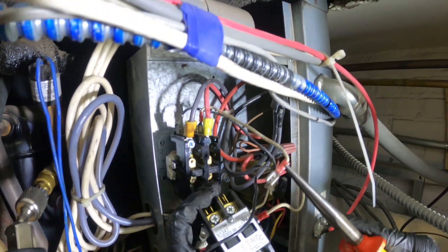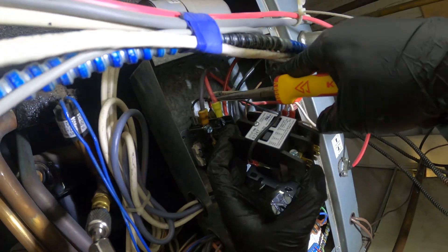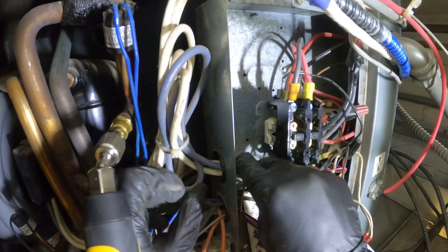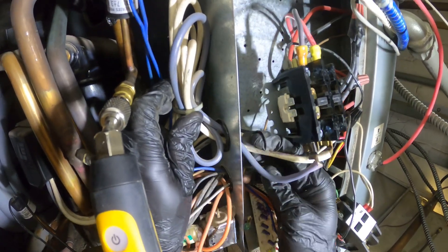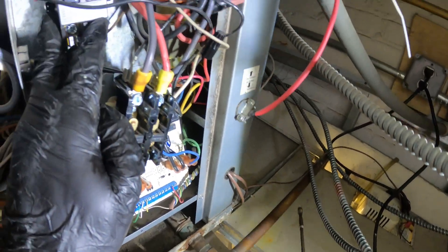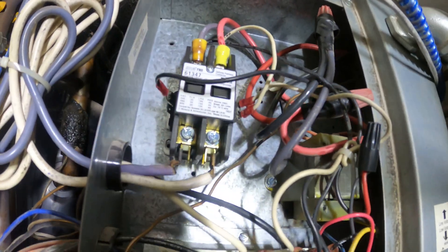One wire goes to the coil and it takes 120 volts from one pole — let's get that one off too. From there I should be able to take off the contactor and just go one by one. It's still a bit tight but that's just because of these two wires here that are tie-wrapped on the opposite end. Just pull that a little so we can keep the tie wrap. And now I can mount my new contactor.